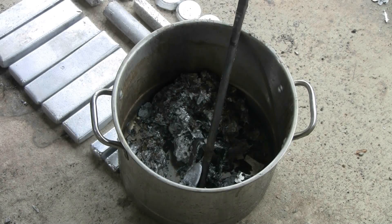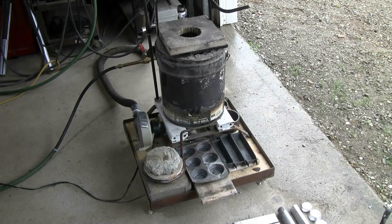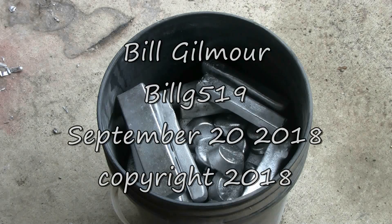Here's a look inside the stainless steel dross pail. I'll have a run of dross that I'll be able to remelt and get a bunch of aluminum back out of at some point, but I'll wait till I have more before I run it. I've got the molds and everything stowed back on the foundry cart. The blower is still running to keep cooling things down — I'll consider it safely cooled when I can stick my hand in there and it doesn't feel hot. Here's a quick look into my aluminum bucket, a five-gallon pail that I dumped my muffins and ingots and bars into. It's pretty much full now — I've got room for maybe one more run of aluminum recycling and it'll be full.